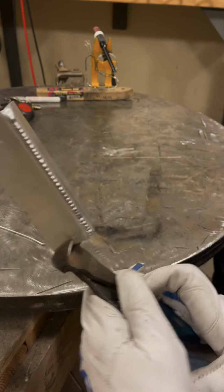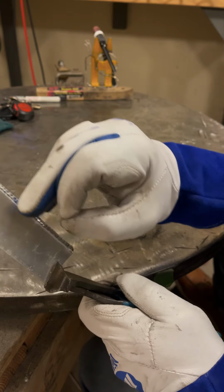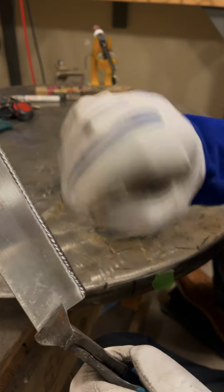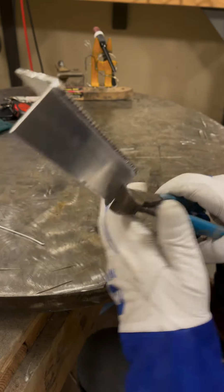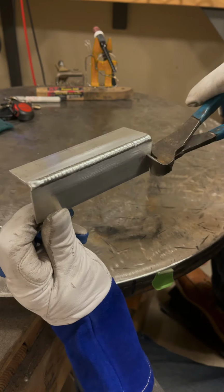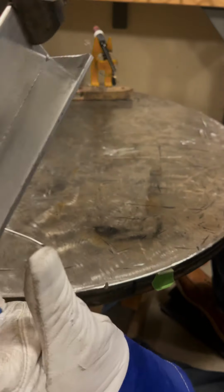So the first thing you're going to notice overall, the height and the width of it very consistent. Your cathodic etch zone, the little white area along the weld, pretty consistent. I'm running a number 8 cup at, I believe, about 18, 19 cubic feet an hour. Overall, pretty consistent. Let's take a look at the penetration.